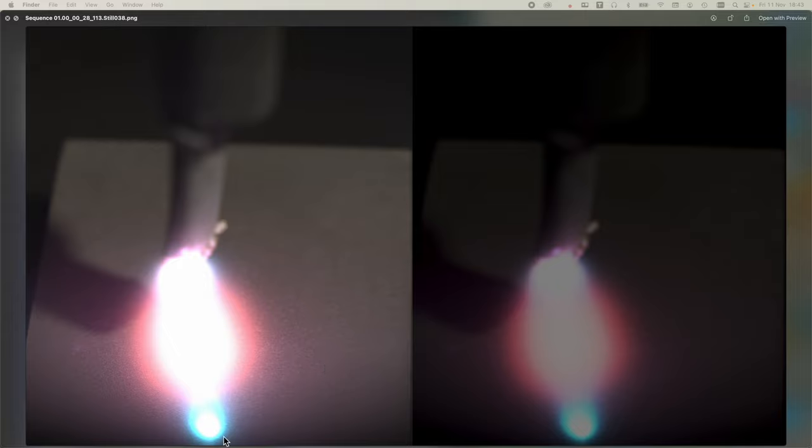Here's our first ecton. It just looks like an arc, but we have now learned that electrons are flowing from the outside through field emission, gathering to a central point, causing the ecton to launch given the surface feature and all the parameters in this highly self-organising event. After the explosion, you get to see some fragmentation, then it dies. This shows the event starting on the cathode, breaching the low-pressure air, and finalising its journey on the anode. There's a little bit of heat glow which fades away over the next couple of frames.